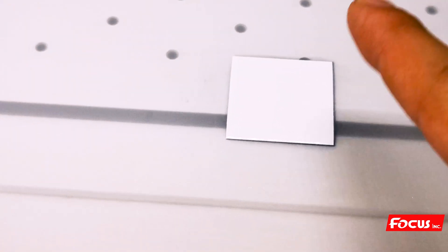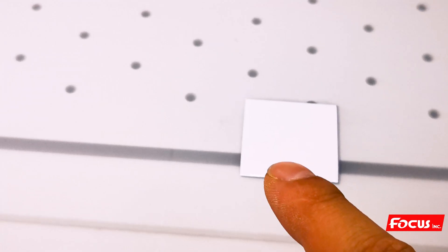This is the print-to-right direction. We also must be sure there is no overlap from top, bottom, left, or right. Here is the print-to-left direction result, and this is the print-to-right direction result. From this picture we can see there is a little bit of overlap — the white ink on top has moved to the left, so we need to adjust the setting to make the white ink move to the right a little bit to prevent overlap. We go to the software and the color offset setting to make a small change, then print again.